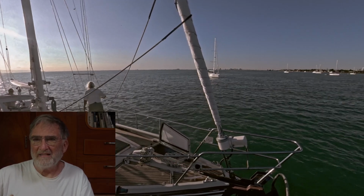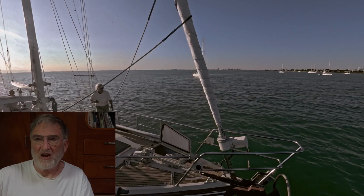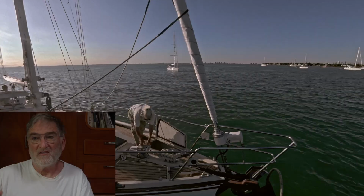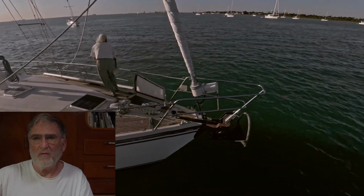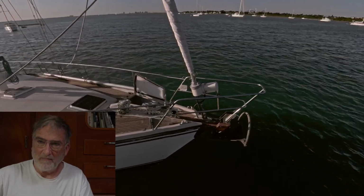Karen starts by getting the needed gear ready. The chain hook is taken out, which we will use as a chain stopper at the very end of the process. The wired remote for the windlass is connected and made ready. The safety line securing the anchor while we sail is removed. Then Karen goes aft to retrieve the snubber line.